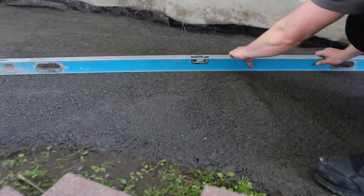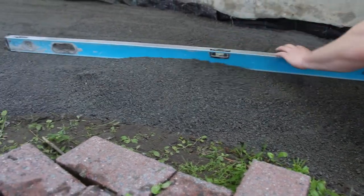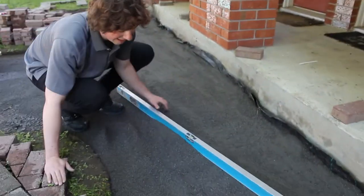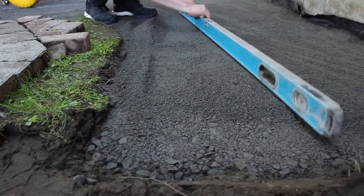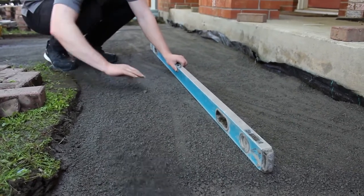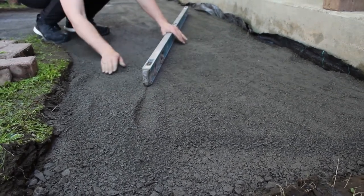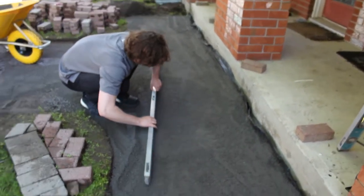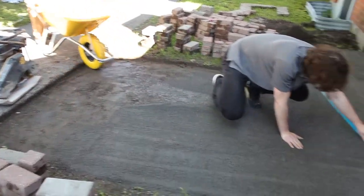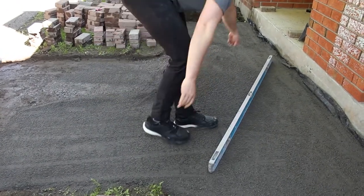So here I have my stone dust. We are trying to get a good stone dust grade over the whole thing to ensure uniform smoothness and uniform slope so everything will be sitting nicely. We are going to compact this grade. I'm checking my level. I'm doing a lot of just smoothing because my gravel grade was very good — which you want to ensure. I don't have to worry so much about my heights and slopes as I just follow the contours I already set out. I'm checking my bubble, my slope to ensure everything's good.